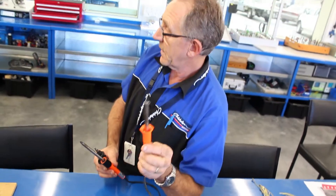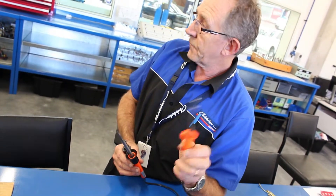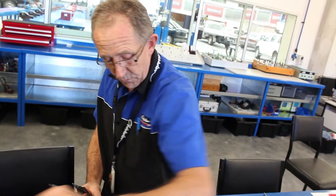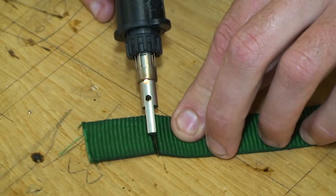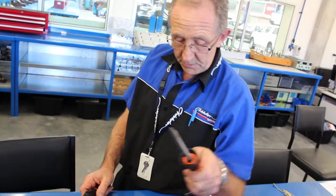This one is regulated at around about 15 watts, which is good for doing circuit boards and that sort of thing. But if you want more heat, you have to go up to a larger soldering iron — around 25 to 30 watts — and that's for terminal soldering, whereas the 15-watt would be too light.